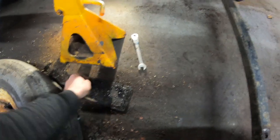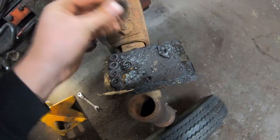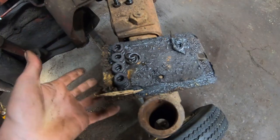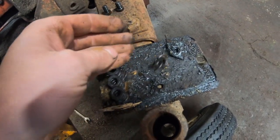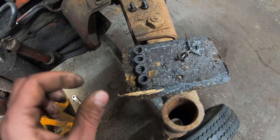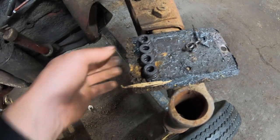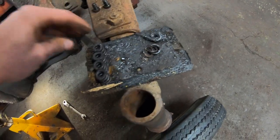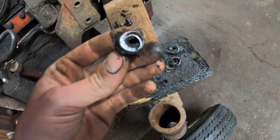So, you have an inspection cover for the clutch, and I took off the two bolts that are right here to remove the cover, and this is what I found. There's all these springs here. A bunch of these are broken. I'm not even sure how many springs are supposed to be in there. This goes on the friction disc, and I don't know, there must be 6, I suppose. They all go in line with the direction of rotation. I don't know if this makes up one more spring or if these are broken. I haven't even pulled these things off yet.